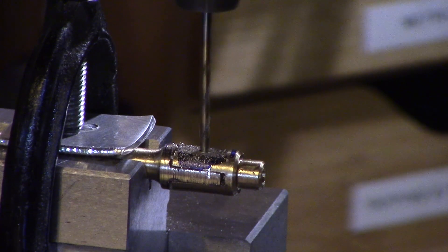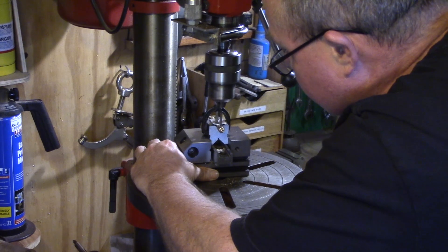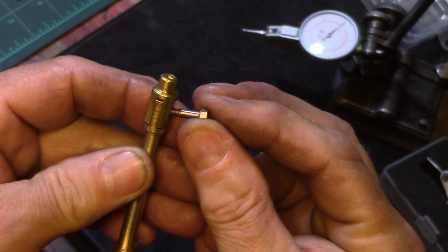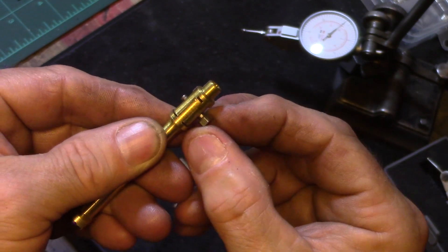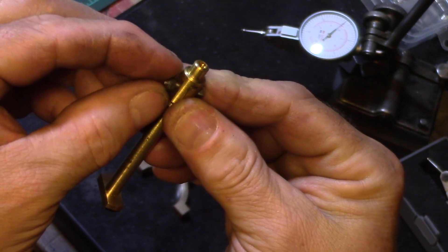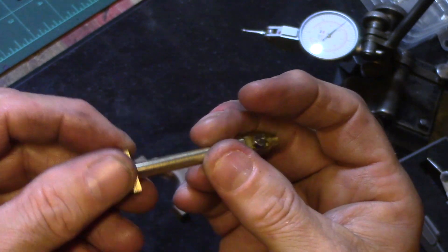This was then superglued together for drilling and reaming. A three millimetre nut and bolt pivot was turned from steel hex bar to join the components and test fitted. The corners will later have radiuses filed on them to allow the clevis to rotate or pivot without binding. Holes now needed to be drilled for the fixing screws to connect to the eccentric strap.